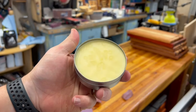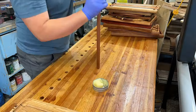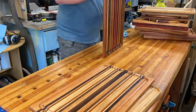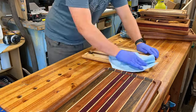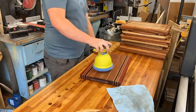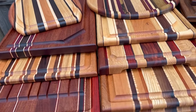I'm adding wood wax — Walrus Oil wood wax specifically. I talk all about this in my Cutting Board 101 video. I don't think anyone makes a better wood wax. The one thing to note: wood wax slows down the curing process of the tung oil. It's perfectly fine to use together — the tung oil on its own probably provides a good waxy finish — but I just love the sheen of Walrus Oil. Take that into consideration; it might make it leak a little oil over the first month, then it's golden with a superior, long-lasting finish. I buff everything with an orbital buffer.